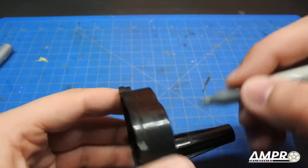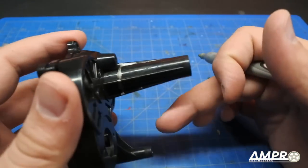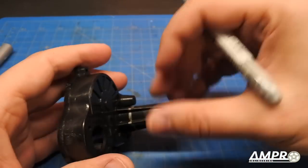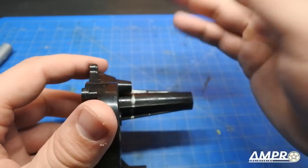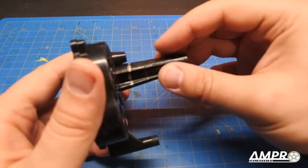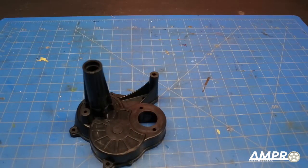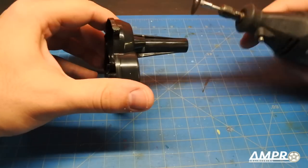It's still nice to have it tidy — you don't want it to look too hacked. There is my silver band. I'm going to run my Dremel completely around this. I have a serrated bit — what this does is instead of melting the plastic it actually cuts it. There are probably better ways to do this; one idea is to use a hacksaw and use the boss as a guide. Again, there are many ways to cut this tube off, but the most important thing is your safety glasses — you only have one set of eyes.